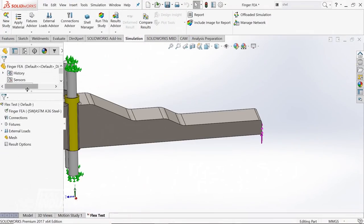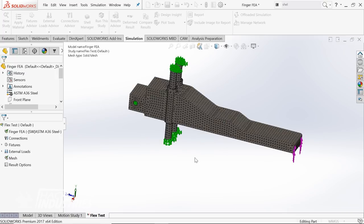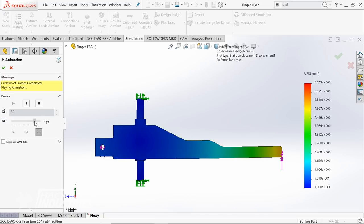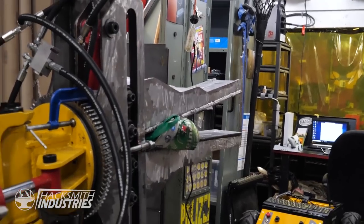In order to make sure that our design is going to work, we put it through a Solidworks stress analysis. We can see at the tip of the gripper is the red, and that's the maximum point of displacement — how much the gripper will actually flex or bend. That's actually less than 7mm, which is significantly better than the previous design. With our previous stress analysis in Solidworks, we calculated about 4cm of deflection. However, that did not account for the slop in the bearings and the guide rails warping during welding. With the new design, since the bushings are much higher tolerance and we're not welding the linear guide rails, those problems should be omitted. I'm satisfied with these results — let's go and modify the gripper.